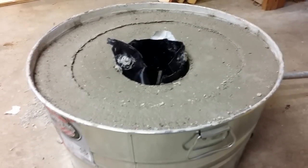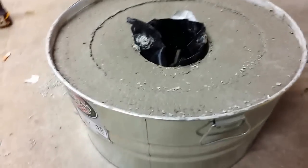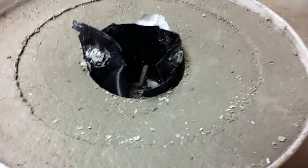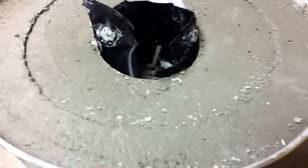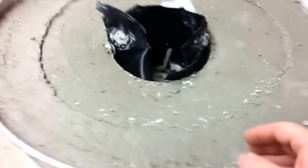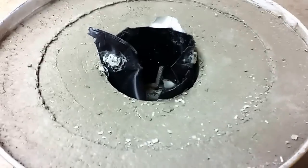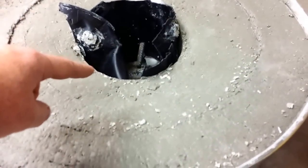We'll keep this covered when it's outside. The depth here is probably a little over six inches from the outside edge to the inside. Normally you don't have to make it this thick to make a refractory furnace, but we did in this case because it's going to be dual-use — both a refractory furnace for melting metals and also for blacksmithing. We'll be able to load the center chamber with charcoal.